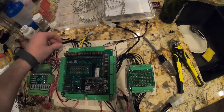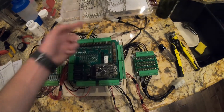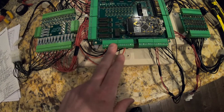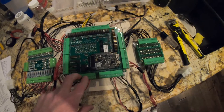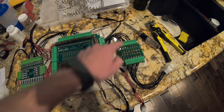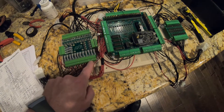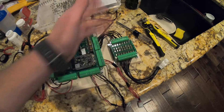We've got some extra chime parts and some extra powers. Then this connector is for your plunger, TV, and various analog things that may or may not get used — might just wire them direct. One thing to note: if you have the newer fuse board, it goes straight across, whereas this one goes in and out alternating — in and out, in and out — versus the newer one where all inputs are on one side and all outputs on the other.